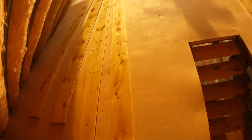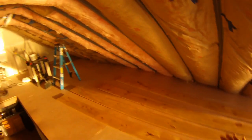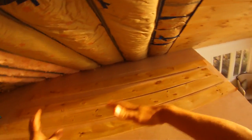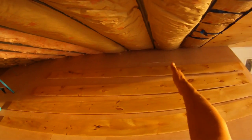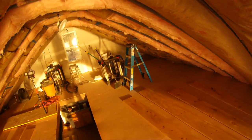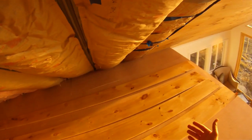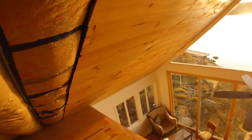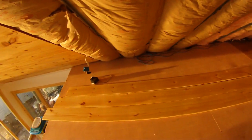The ceiling boards are going up — we went with 16-footers and 14-footers, staggering them: a 16-footer, then cut down to 10 feet, staggering the joints. We're starting at one side of the ceiling and working our way across. In the summertime it'll be nice and cool, in the winter the insulation will keep the heat in, and it'll give a nice clean look. We've polyed the boards and they're drying right now.